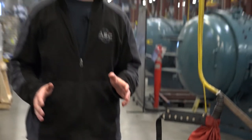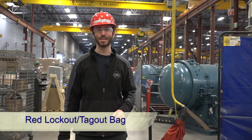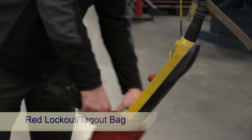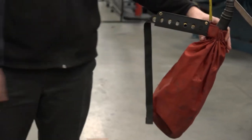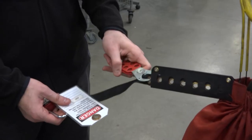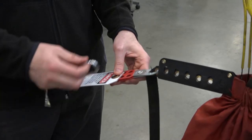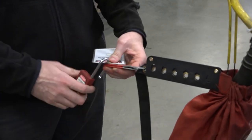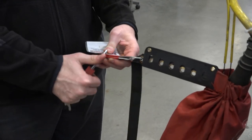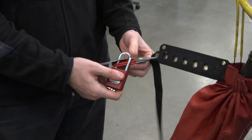The second method for locking out a crane is using one of these red lockout tagout bags. Take the bag and slide it over the crane pendant — that's a great visual indicator to everyone around that that crane is off limits. Situations where you would use a crane lockout tagout bag are where you'd want to keep one of the cranes in the bay energized, because using the bag doesn't take energy away from the crane and the other cranes throughout the bay can still be used.